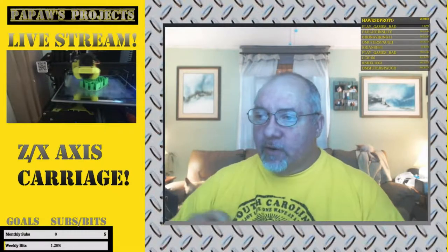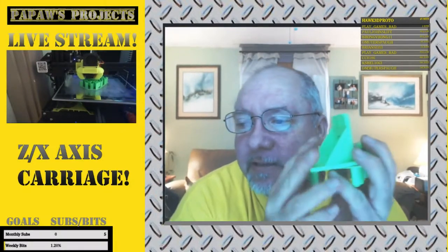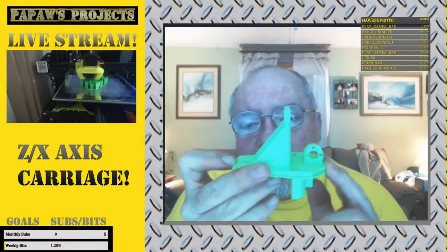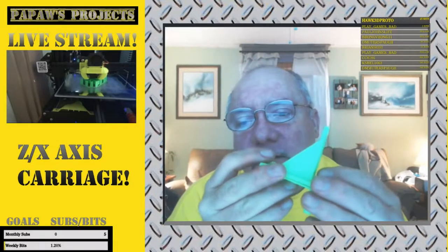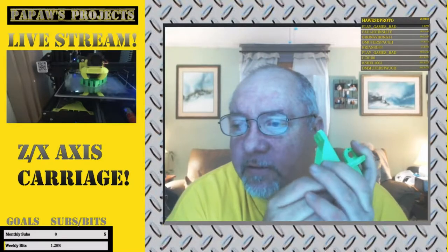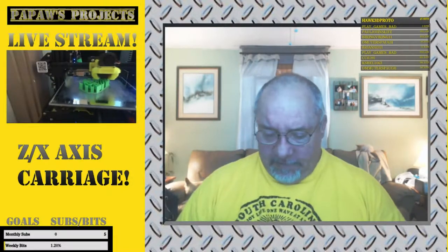I'll give you a rundown of what I've gone through trying to get this thing to work. We were getting pretty close with that version, but layer adhesion sucked. So I ended up tearing my printer down, cleaned some nozzles, put a used nozzle in it after I cleaned it — and it started leaking around the nozzle. I didn't have it tight enough; I did not heat the nozzle before I tightened it, so I had a big glob of plastic to get off of there.